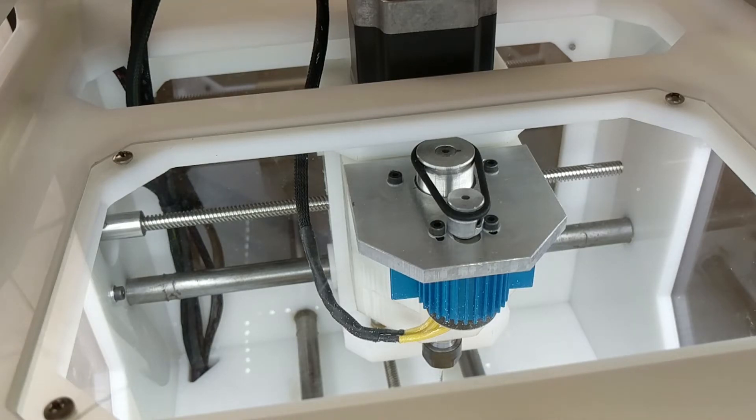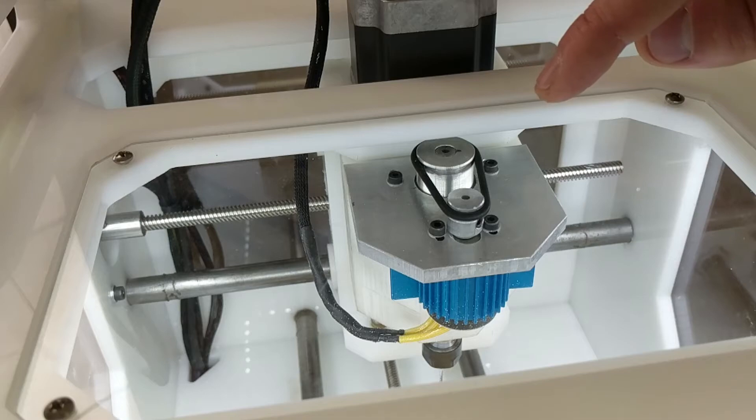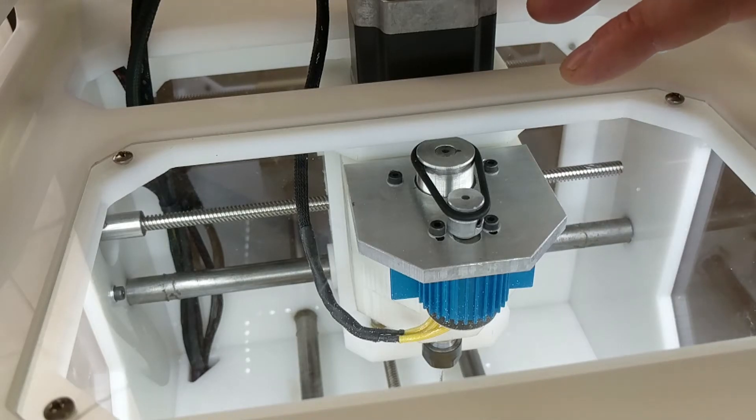Here you can see my brushless motor setup. It's not ideal — this is actually an in-runner motor, an old RC helicopter motor I had laying around. An out-runner with a lower KV rating would be a better motor choice, but use what you have. The pulleys I turned myself on the little lathe, and the belt is just an O-ring. I thought the O-ring would be my limiting factor for power, but it actually grips really well. The limiting speed factor is that the O-ring starts to expand if I go too fast. I only need to be spinning at about 20,000 to 30,000 RPM for most of the work here. My power supply is the limiting factor right now — I need to put about 30 amps into that motor to really get it to sing, and I'm putting in like 8 amps right now. I have a supply coming, but for now it seems to be working okay.